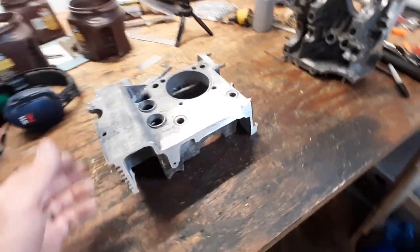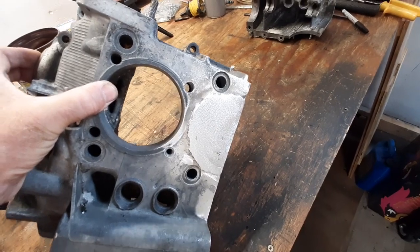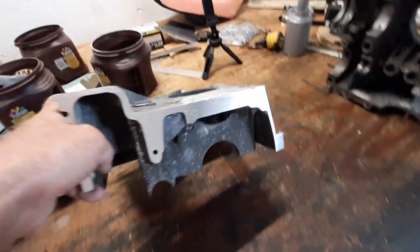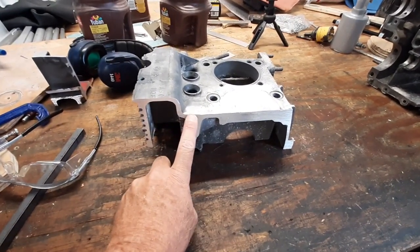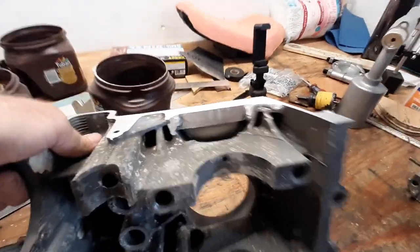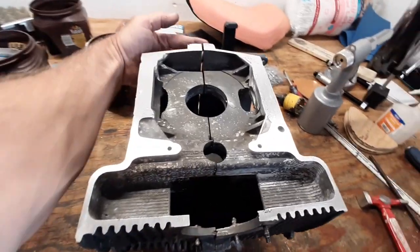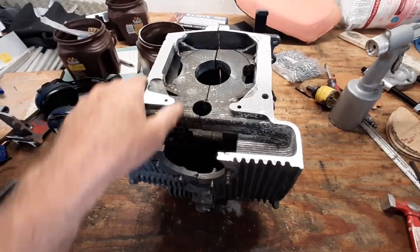I am very pleased with the way this turned out. There's the fill plate in the side. The holes where the other cylinder studs are — they're plugged up. Got a nice smooth surface in the back. I filled in the area here where the other push rod tubes went. We need to put a screw there. Plenty of material to bolt into right along there. Here's what it looks like with the two case halves together — thing looks really good.